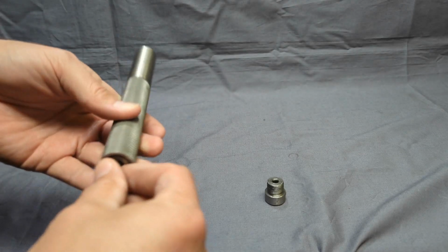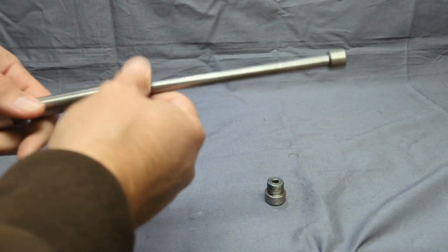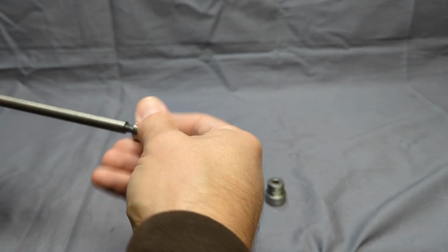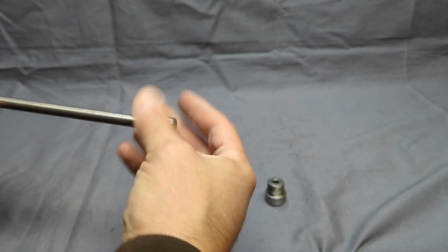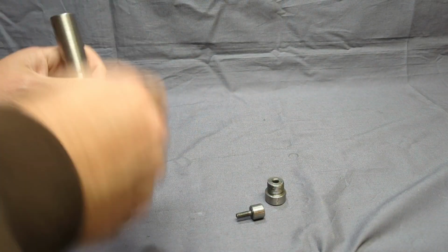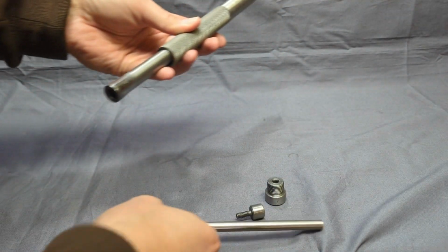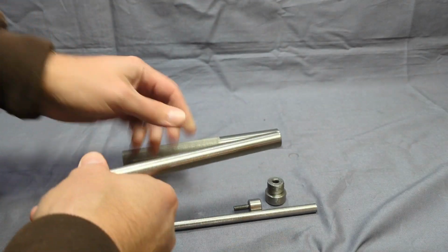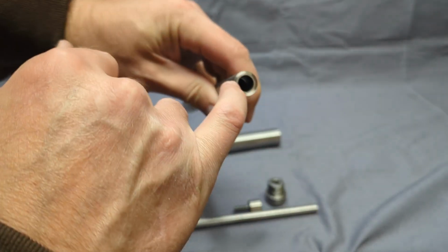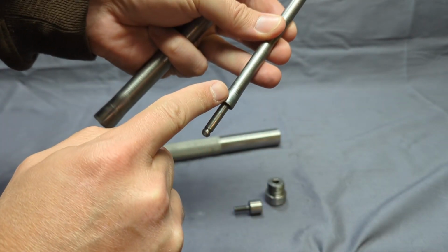That's really the only mechanical part besides the tapers that keep everything in position. And the tip unscrews. I think these are 1/4 20 threads on the end. And there we go. And then it just, like a Russian nesting doll, comes apart. But you can see the tapers at the bottom, the middle section. There's another corresponding taper inside this one that goes with this taper.